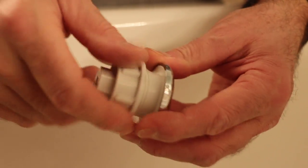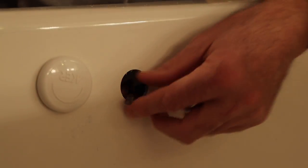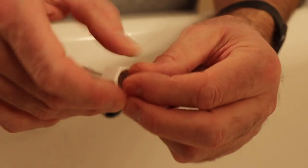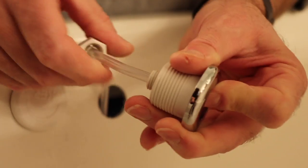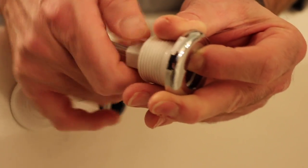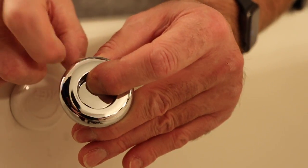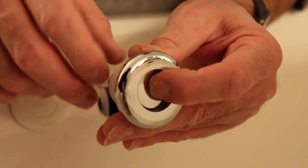So I have my new on-off switch here. I'm going to take this ring off and run this on the back side through the tube — I checked it a little bit ago and cut the tube to the right size for this. I put the tube through the hole there. I'll carefully insert the tube into the new switch and tighten this onto it. Now while I inserted the tube and tightened this nut, I was pushing in on the on-off button. What that does is it allows it to stabilize the piece that it screws into.